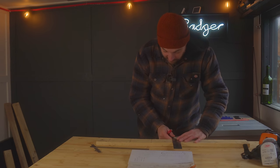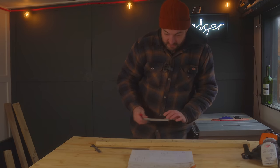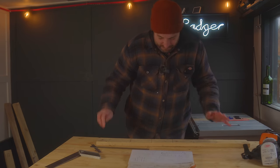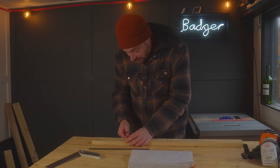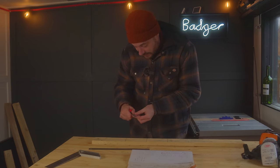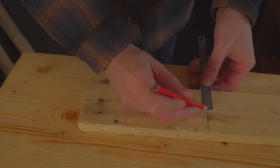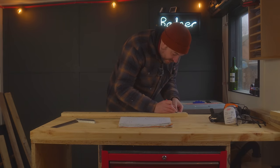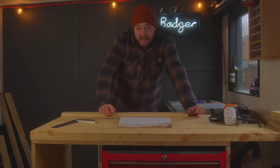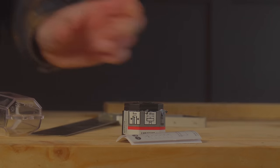My calculations are actually wrong and I've got seven glasses, but that's even better because I was only supposed to do six. Now that's done, I'm going to mark out the centre point onto each one of these lines, which is four centimetres. Now I need to drill a hole on these centre lines, so I've dug out an 18mm forstner bit and I can get that chucked up in the drill and drill through on all of these seven centre points.